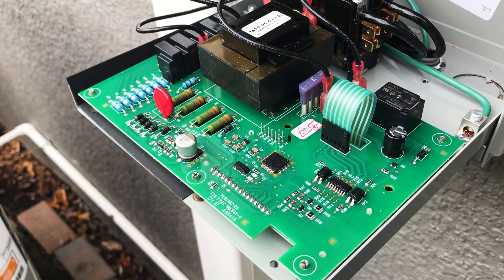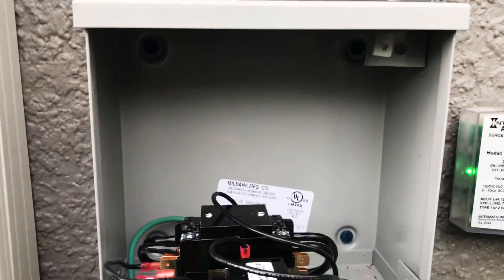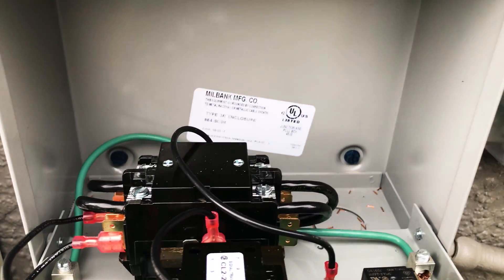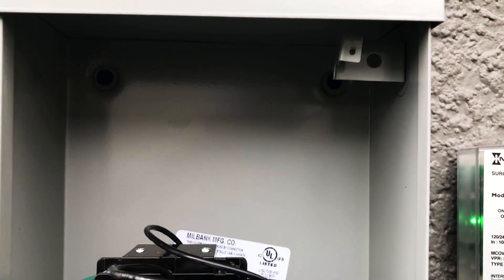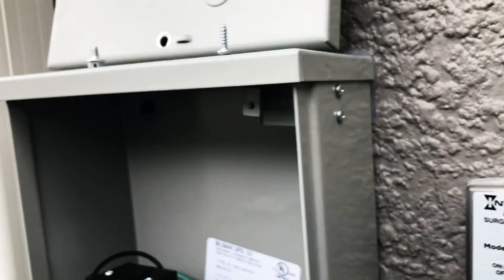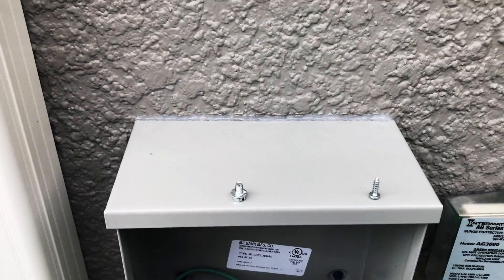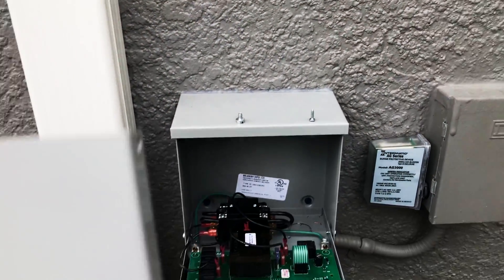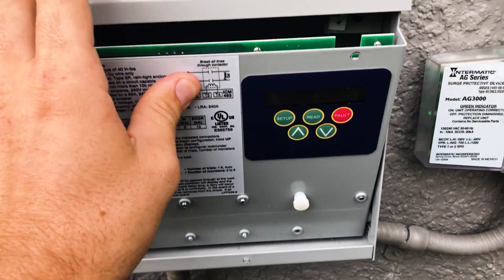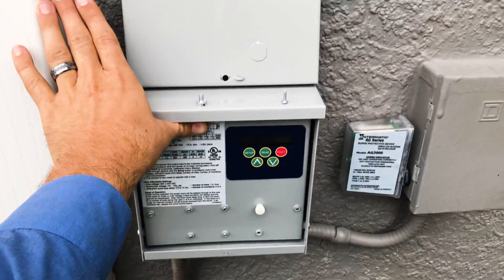On this board you also have a three amp low voltage fuse. You have four different TAPCONs — upper left, upper right, lower left, lower right. The upper left one is a little bit tricky to get in, so you do have to remove these two screws to get easy access to that upper left hand side. Make sure everything's perfectly level, and silicone the top portion that's up against the wall. Then close it up. This particular one has a set screw right here.